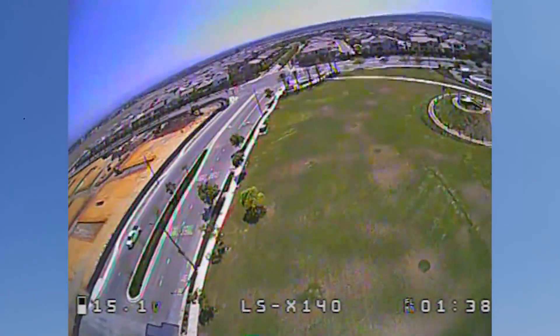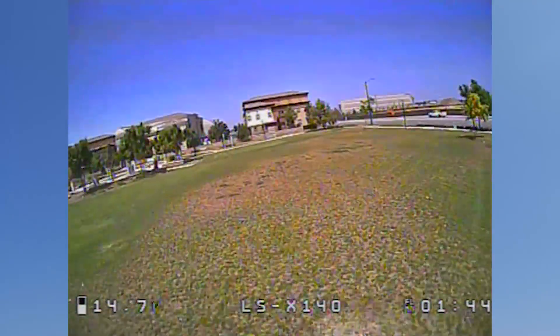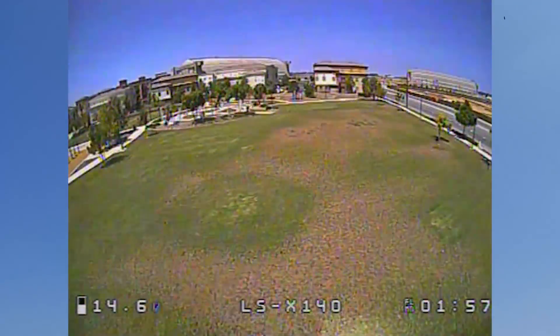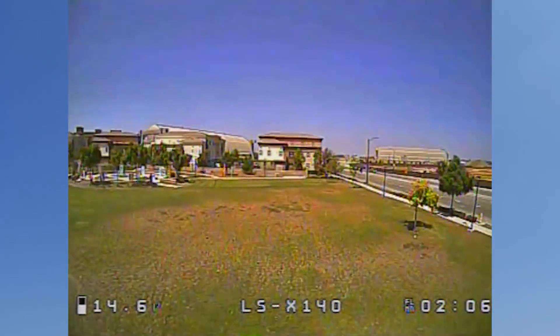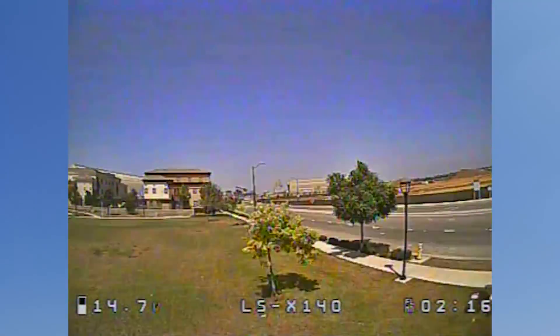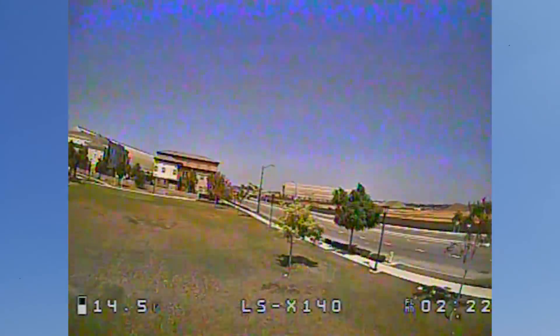This is really fast — this park is way too small for this quad. I think adding a little more TPA will help, maybe also dropping the D gains a little bit. But it's good enough to fly. It's ridiculous how much float it got there. The tune isn't perfect. I'm getting a beep now — battery warning. The 1206 stator size might be a battery killer; it's going to draw more amps than the 1106 even at 4500kV because it's a bigger stator.